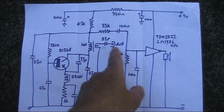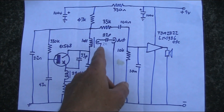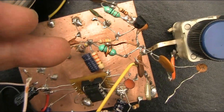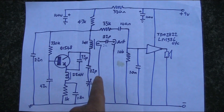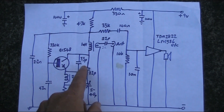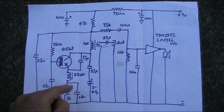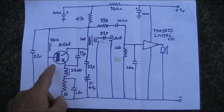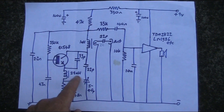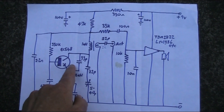The signal from the antenna is coupled by two turns of wire — I've used enameled copper wire from transformers. Just two turns is enough, with short wires to connect to earth. I've assembled all the parts on a printed circuit board, where the earthed parts are soldered to it and the other parts are floating. I'm using a BC548 transistor — a 2N3904 or any NPN small-signal transistor should be okay at 27 megahertz. There's also a 22 microhenry RF choke that helps determine the quench frequency.